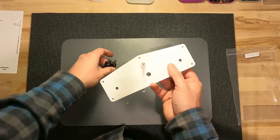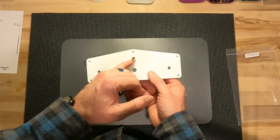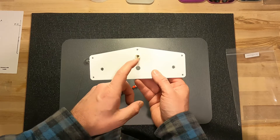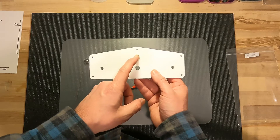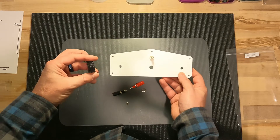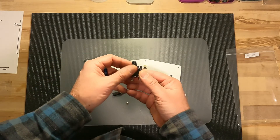The white is power in, so when you hook your controller up, power in goes with white. You want that breaker or fuse to be between your power source — which is your power supply — and your controller. That's pretty much the basics.